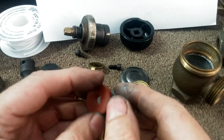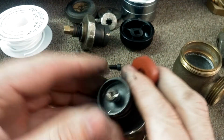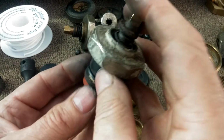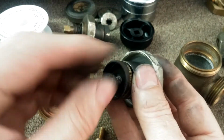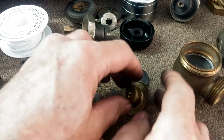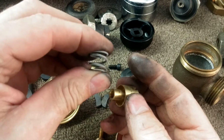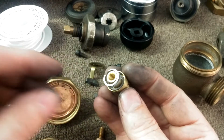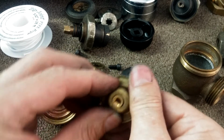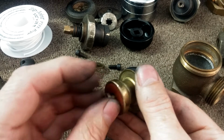The washer, this is hardened rubber material, and they reuse the same size roughly, so that fits in the old early 1920s version, although they simplified again the cover, the holder. Inside of here is a very well designed system that this spring is no longer steel but is corrosion resistant, probably phosphor bronze or something, and it is protected by the construction from direct steam flow. And it's assembled thusly.